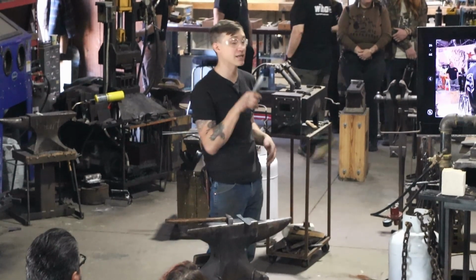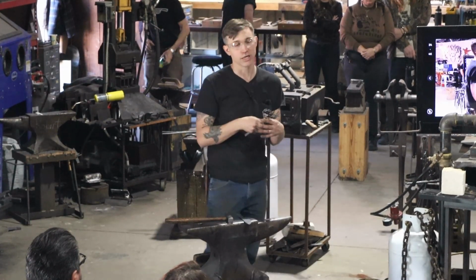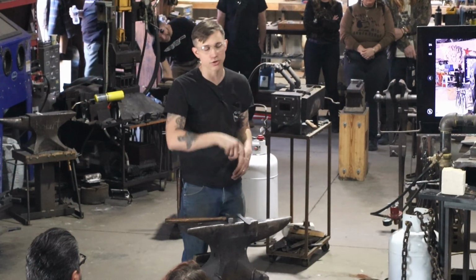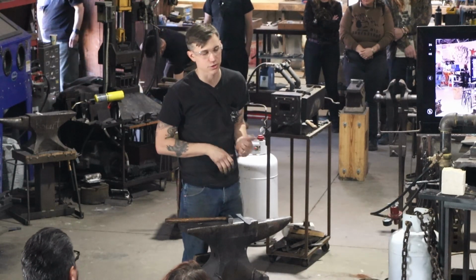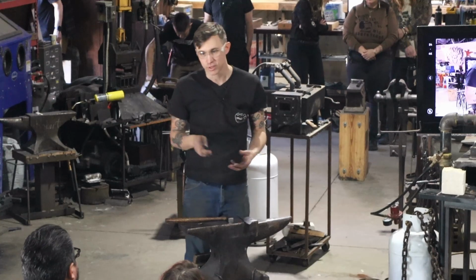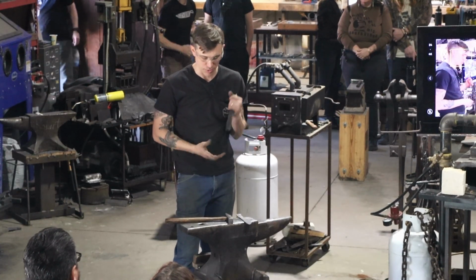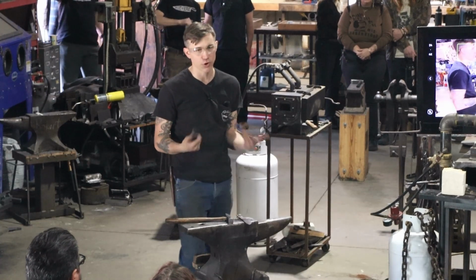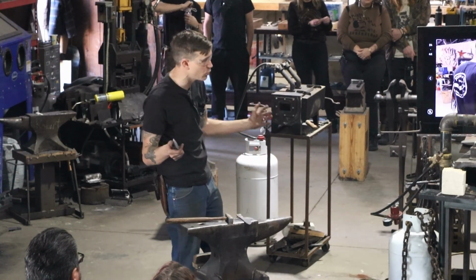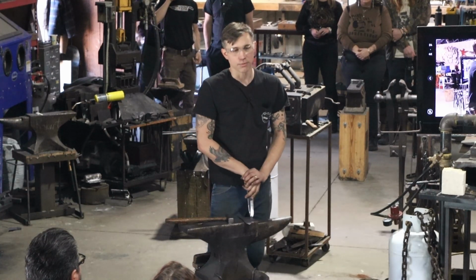That's oftentimes, and it's a heat control thing too. Jumping from 60 to 120 is a lot easier and doesn't require as much time on the grinder, and you're using those sharper belts. So that's a hard one because we all have gone through that. Belts are very expensive. So we've all gone through that situation where it's hard to pay for the belts. They say use them like they're free. It's just not reasonable. No one will do that. But be thinking of it like that.